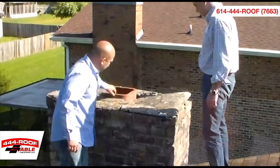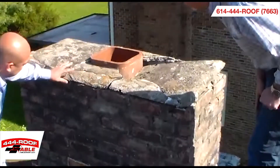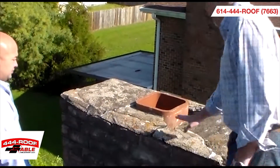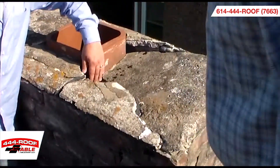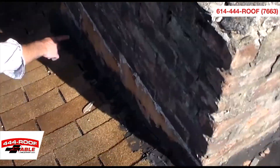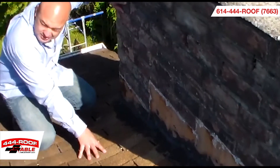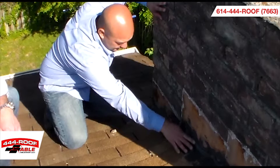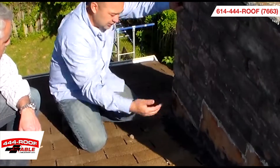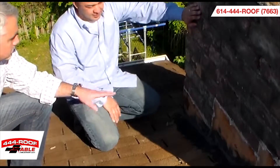Let's walk over here and take a look at the chimney. We have a chimney cap that's failing really bad. It looks like they've had some tuck pointing done at one time — that's where they've come back and fill in the mortar. This chimney is in really rough shape. They're to the point now where they need to have some bricks replaced, as the spalling is coming apart, and have a new cap put over the top. There's actually a hole that comes straight through here — you can literally put your arm all the way down inside. So you know this is an area for water penetration. Along the side of the chimney is the original counter flashing. This is a home that has two layers of roofing on it, so when they put the second layer on, they actually ran their shingle up against the old flashing and put a mastic sealer on here — this really isn't the proper way to do things. With the roof replacement, we're going to tear all that off, make sure the chimney has all the right underlayment wrapped around it securely, flashed properly, and install brand new counter flashing on the chimney. It's a good idea to have complete new counter flashing installed on a brand new roof every time.